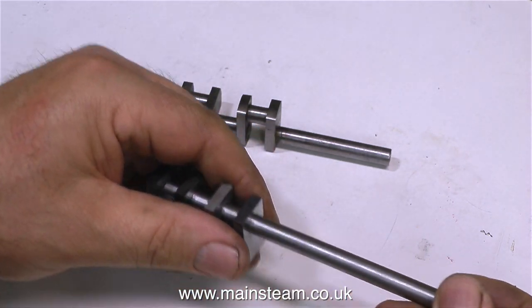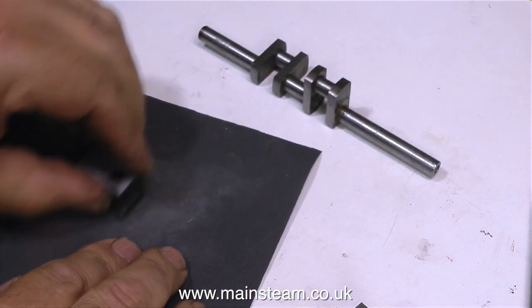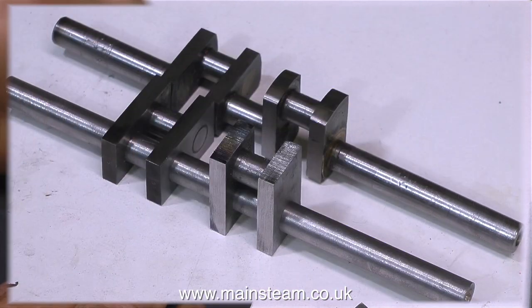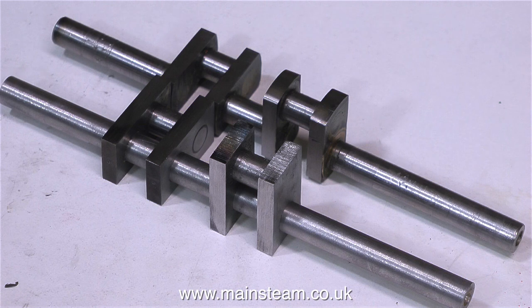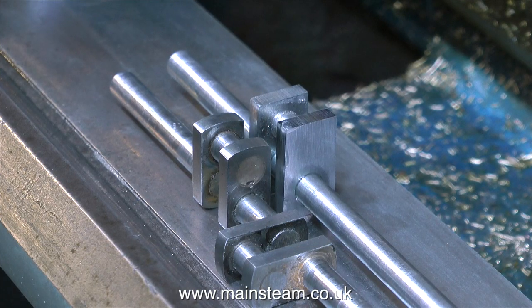This is a very harmonious job — under no circumstances must any of these parts bind on the main crankshaft. If you force the crank webs on, they'll go on okay, but when you cut out the piece of crankshaft between the webs, the crankshaft is likely to distort and will not run true when fastened into the main bearings of the engine's bed plate.